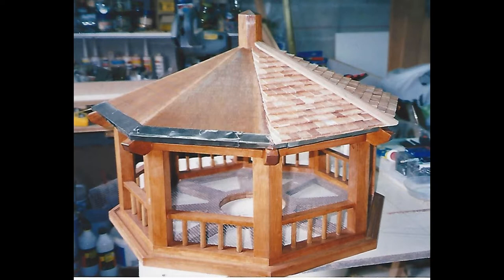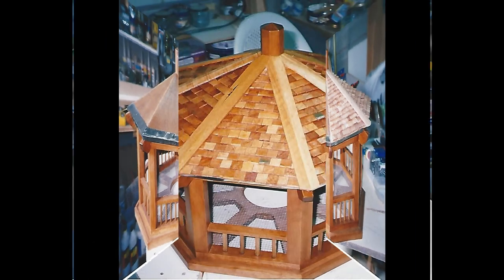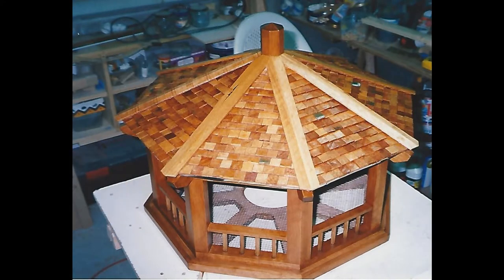A shim shingle, actually, a miniature. Then I cut the widths and then I cut the lengths. Then I came back with that layout and I would glue and staple each shingle in place and then cut them as I got to the edge, to form to the angle. I did that piece by piece all the way around. And it has a very precise overhang over the metal flashing. Later I finished that off with a ridge cap, and this is what it looked like finished. I thought that it was just beautiful. To me, that was the creme de la creme, the icing on the cake.